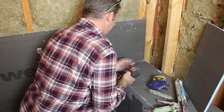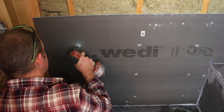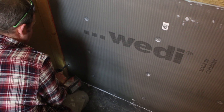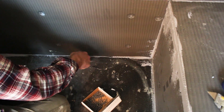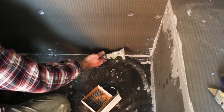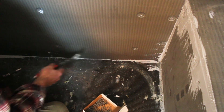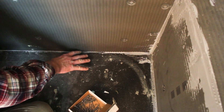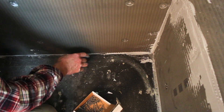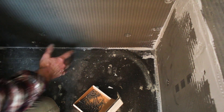This is the wall of the bench, and I'm still going to keep this up about four inches. This is a common issue—if you're notching out and cutting the pan down, you might end up with a little overcut for your dado like I did here. It's not a big deal. Once we go to the final application of the sealant, we'll just fill that whole groove in. You might not be 100% accurate when you recreate the dado—the factory edge fits pretty nicely, but I'm about an eighth of an inch off. I'll fill that, and then we'll fill the corner.